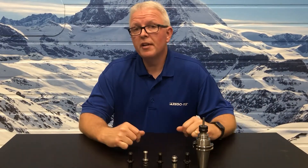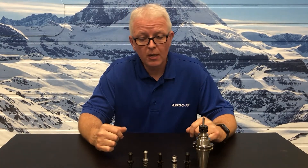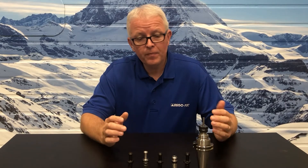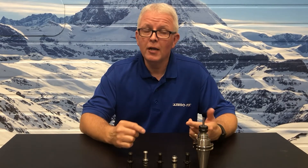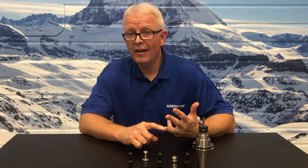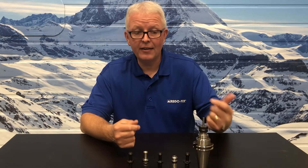What's the value that we recommend and what happens if you get it too tight? There are a number of pull stud manufacturers in the market today and each one has their own value they recommend for pull stud torque. But what does that pull stud torque do to that tool holder? To find out, we are going to go over to the torque block and assemble this tool holder with a pull stud and measure the TIR values at hand tight, the recommended value of 50 Newton meters or 36 foot-pounds, 50 foot-pounds, and as high as 80 foot-pounds to see the effect that each one has.